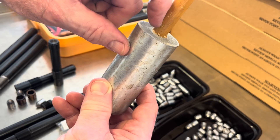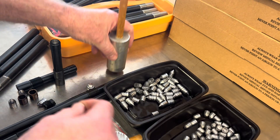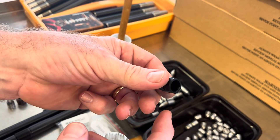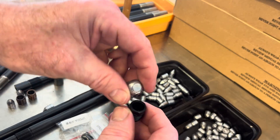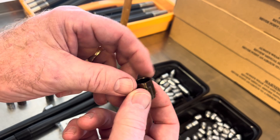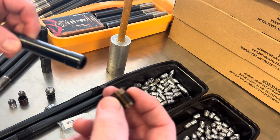It's shredding the aluminum around the edges, creating lead dust — all that stuff eventually goes out the barrel. But every now and then one of these pellets gets a little cockeyed, doesn't go through, and that 4,500 to 5,000 PSI has to go somewhere, and what it does is shatter the inserts. I tried to break one of these — normal things like hitting it with a hammer and beating something down into the center would not break it. It's very, very strong. The only reason my inserts are working so well is they're made of steel.